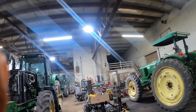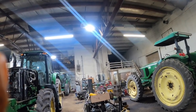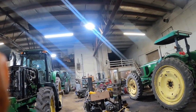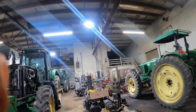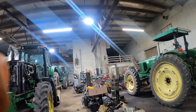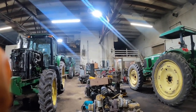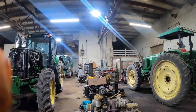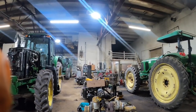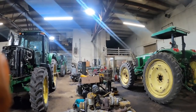I've been messing with a John Deere that's back there — that one's kind of confusing. It only does it when it's stone cold. When you first start it up, it will default to park and throw some TCU codes — transmission control unit codes. It'll do some different things, but by the time you get into the addresses to monitor it, like TCU address 47 and TCU address 11 to monitor sensor speeds, it quits doing it. You can drive it around and it'll be fine. It only does it when it's cold — really weird, never seen one do that.